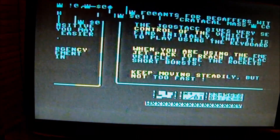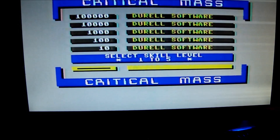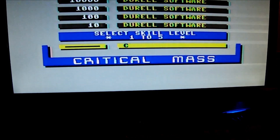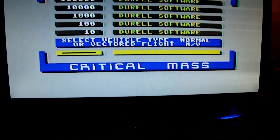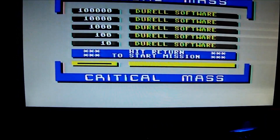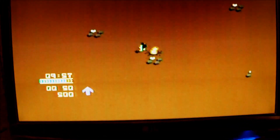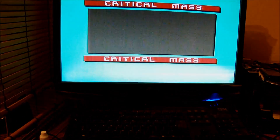There is something I don't like in the game's instructions but let's continue. I strongly suggest that whenever you perform any kind of repair, you use sockets. For obvious reasons, you can always swap, test, and try several chips and mark them as good or bad when sockets are available. It's a good practice to use sockets at all times.